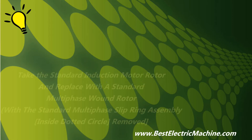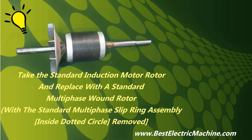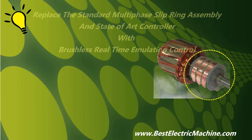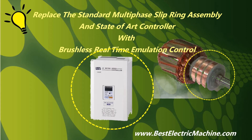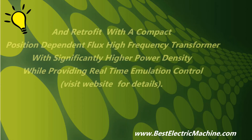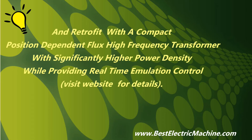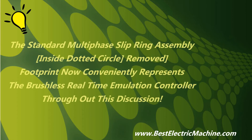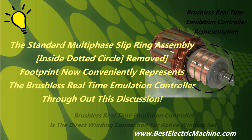Simply retrofit the passive rotor element, such as the squirrel cage winding set of the standard induction electric motor, with a similar active balanced multi-phase AC winding set as the stator, and replace the traditional multi-phase slip ring assembly and state-of-art electronic controller, such as any derivative of field-oriented control, with a brushless real-time emulation controller to sensorlessly and automatically assure synchronized speed and position to frequency and phase. Multi-phase excitation power is supplied directly to the rotor active winding set in order to eliminate any functional reliance on reluctance or slip induction with known speed regions of discontinuity and instability, such as about synchronous speed where slip induction becomes vague or ceases to exist. Replaced with a very compact, high-frequency, position-dependent flux rotating transformer of significantly higher power density inherently providing the analog processing for real-time emulation control, the multi-phase slip ring assembly may well represent SynchroSim's brushless real-time emulation controller assembly.